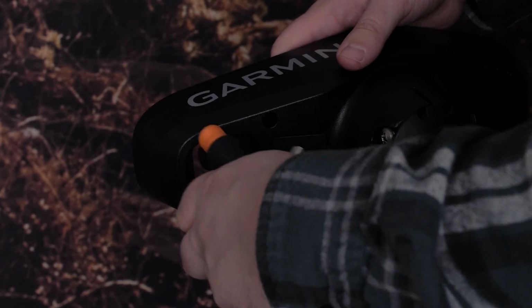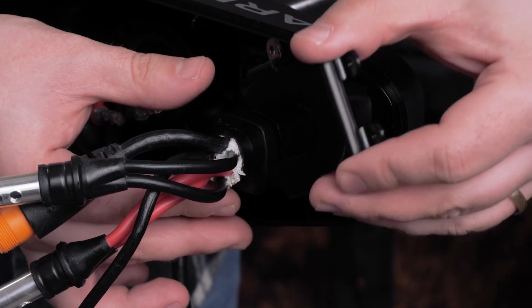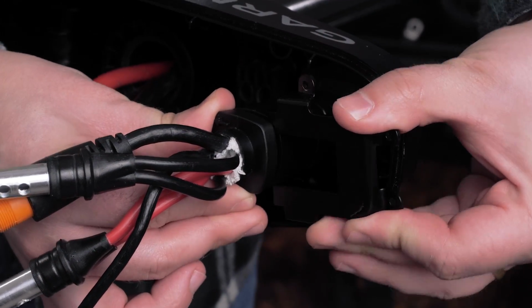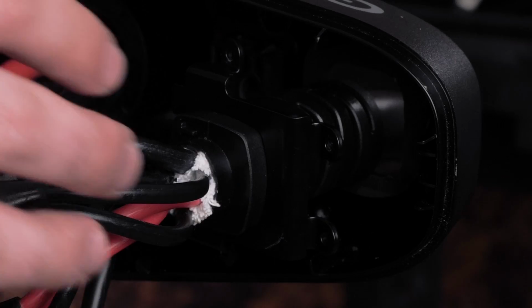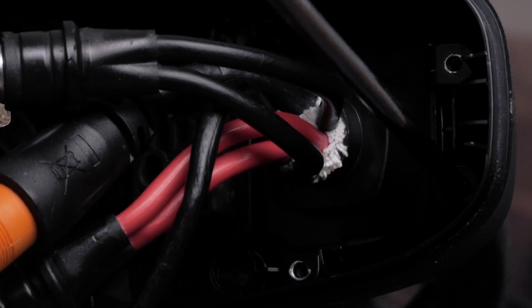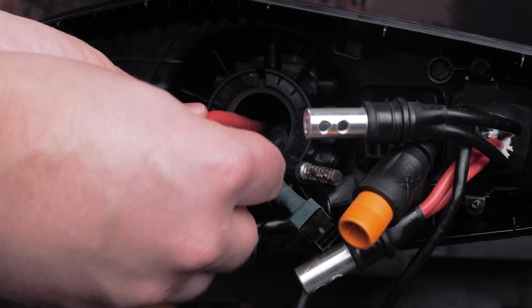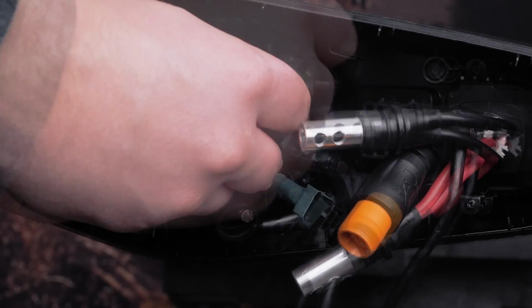Then, insert the coil cable into the opening on the bottom of the shaft cap housing. Slide the bracket onto the coil cable. Now, align the bracket with the 4 holes on the bottom of the shaft cap housing. Tighten the 4 screws provided in the service kit using a number 1 Phillips head screwdriver. Place the rubber covers over the power and ground wires.